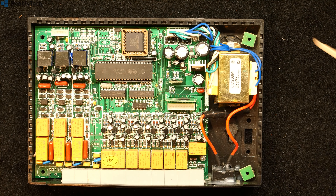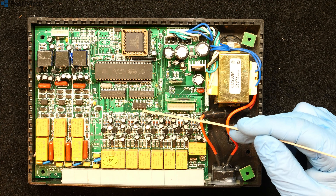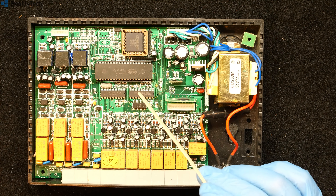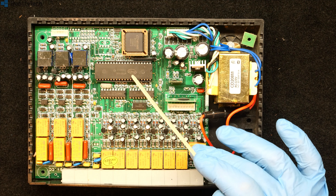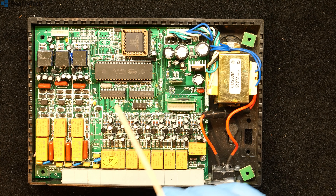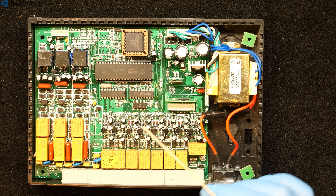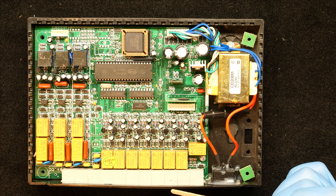We've done a bit of looking up. I've managed to misplace my plastic pointy stick, so it's carbohydrate phone time. We've had a quick poke around and a look at what chips we've got. There are more design limitations to this than we found. The most boring chip is an LS244 — just a buffer. Then we have two DTMF decoders, a 16x8 or 8x16 switch array, and a microcontroller. I don't remember exactly how this works so there could be limitations here.